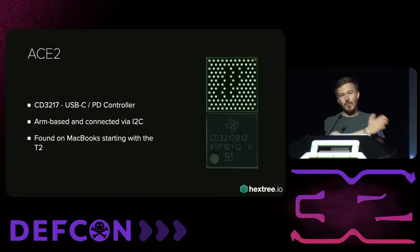In the end, I had a very simple payload — a trivial memory reader that takes in an address and returns four bytes at that address. Attempt two: we replace the USBW command handler and start glitching. We again wait for the battery to run out, start over, and so on, because the glitch was not very stable. But eventually I got a success. I sent the USBW command with address 0x0000 and got back 0x00006200. This is a little-endian machine, so you reverse it. If you do a lot of ARM reversing, you will immediately spot this — it's the stack pointer reset value. We just read address zero of the physical memory of the chip. So we can read and also write arbitrary memory on the ACE3.